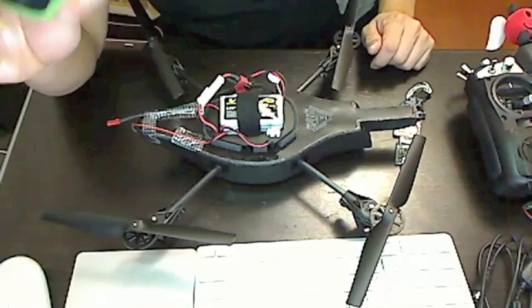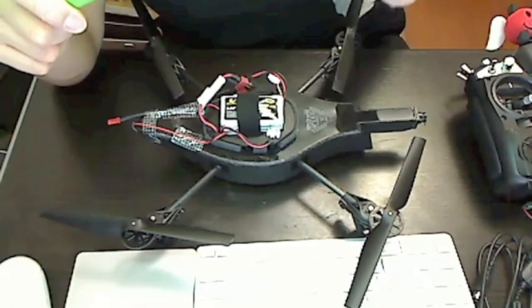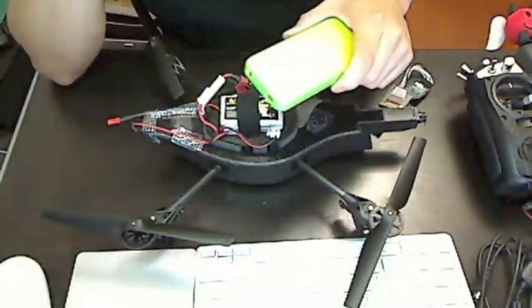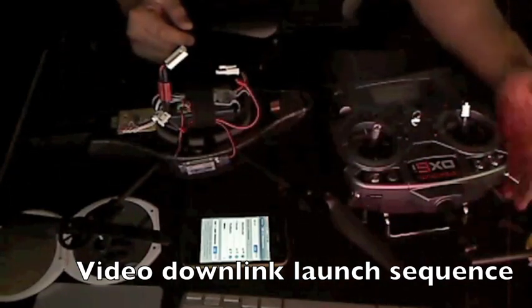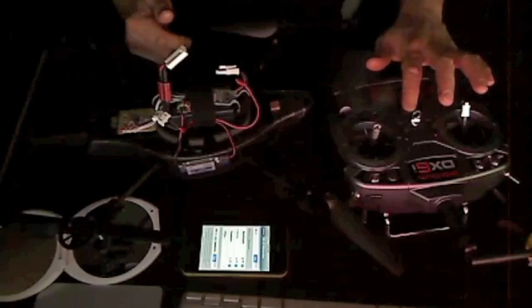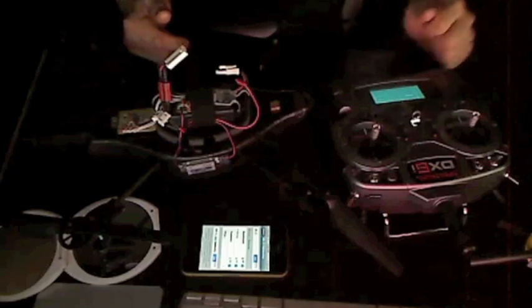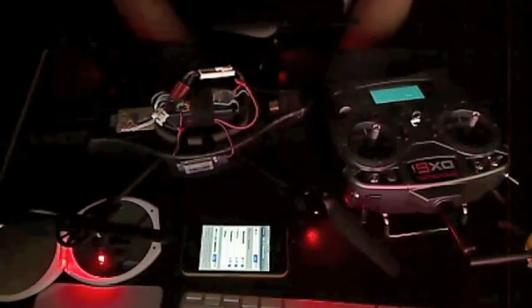After this mod you can still use your iOS device to control the AR drone — just unplug the Yellow Jacket and pair it up as usual. You can even use your transmitter to control the AR drone while using your iPod or iPad to receive the video signals. To do this, follow a specific startup sequence: on your iPhone, make sure you're on the Wi-Fi network settings screen, turn on your transmitter with the right model selected, center your sticks especially the throttle, then power on the drone by plugging in the battery.